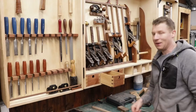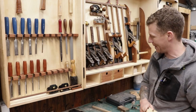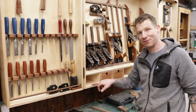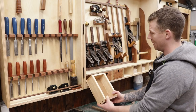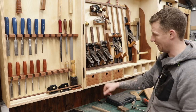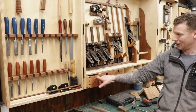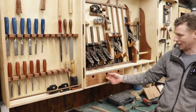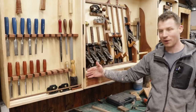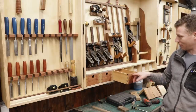We'll have a quick look. Okay guys, there we go. We have three drawers done. I have a little stop in place, so I just drilled in a little piece of MDF right here, just as a stop. Again, we have a chamfer back, so we can tilt them in place and just push them in. I just drilled a 25mm hole, like a little board hole for all the world, a little finger pull, just for pulling them in and out, because I'm not going to put any handles or knobs on these, because I want them to be flush from when I close the cabinet door.